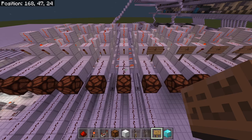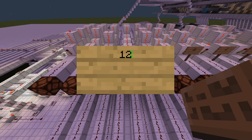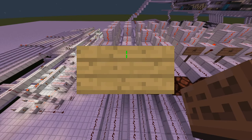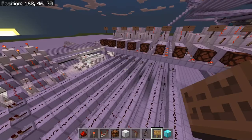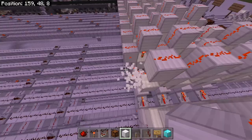Yeah, so BR means branch, BRZ means branch if zero, BRN branch if negative, BRB branch to the value in the B register. So obviously not all of these are immediately obvious. If you've never seen an instruction listing before, you'll take a bit of time to learn how to read them, but to anyone familiar with how instruction sets and assembly code works, the patterns are fairly easy to spot once you've had a very brief introduction. And ST and LD meaning load and store are fairly common. I should say this particular architecture was designed by Professor David May at the University of Bristol as part of the teaching there.